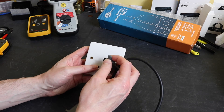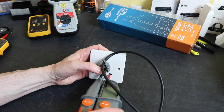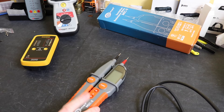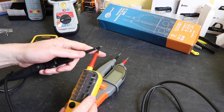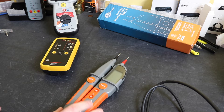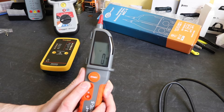As with the Fluke, this has the earth pin adapter moulded onto the cover, so you can push it into a UK socket to move the shutters, and the meter can stay clipped together while you measure mains. You do have to hold it in as it springs out if you don't. A fundamental difference from my other units is that this must be turned on first — one press of the button at the bottom turns it on, you get the battery level, and it defaults to the setting it was on when last switched off.